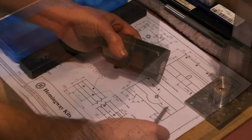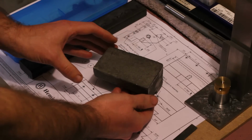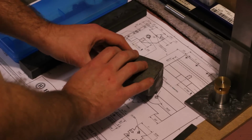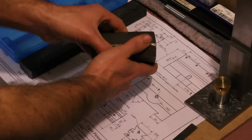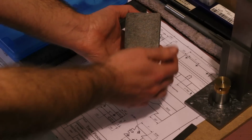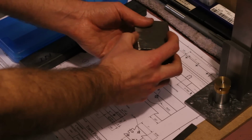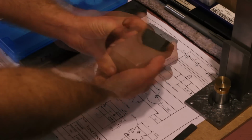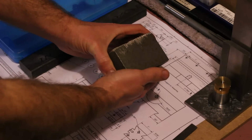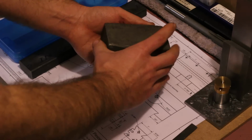One thing I'm finding with machining castings is that it's pretty important to take some measurements of your rough casting and think about them in terms of the dimensions that you need on the finished product. This is a pretty good example. If you look at this, you don't have your real square surfaces here. This is just a rough casting. Somewhere encapsulated in this rough casting is the final part that you need. Making some careless decisions as to what you start with for reference surfaces when rough milling can lead to you running out of space when you're roughing the part out.